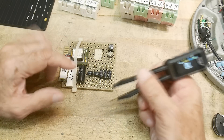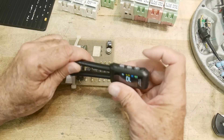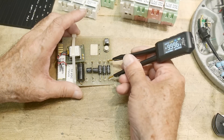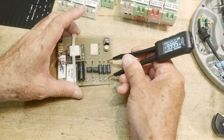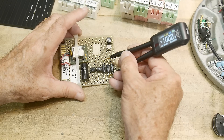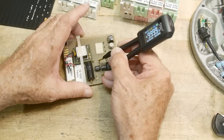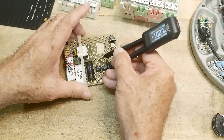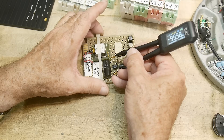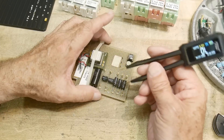I have a board here with a bunch of 0.01% resistors. Let me go back to auto mode. So 9.995 ohms — that's pretty damn good. The next one is 100.0 — that passes. 9.995 — that passes. 1.007 — I'd say that's a pass. And 9.999. So it measures things very accurately. I like it.